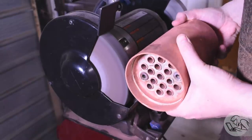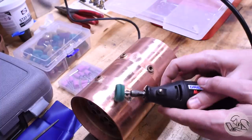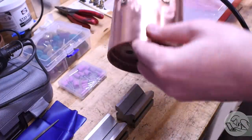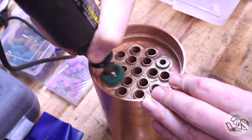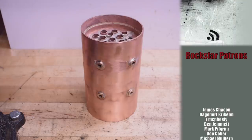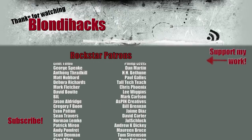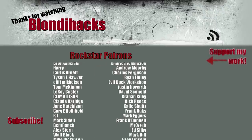And just because the internet gets sad if I don't do it, I'm going to polish up the copper a little bit. This is just for your benefit because this is all going to tarnish in a week and it's all going to be covered with lagging and other fittings before it's done. You will never see any of this copper once the boiler is finished. But just because I love you I'm going to do a really half-assed polish on it. It is actually worthwhile to polish the tops of the boiler bushings to make sure they're going to seal properly — they get pretty gummed up with flux residue and loctite during pressure testing and silver soldering. There's still lots of fittings to make and the firebox of course, but the pressure vessel is the hard part. And in that regard, this ladies and gentlemen is a good boiler.